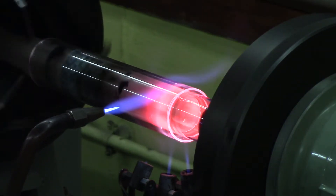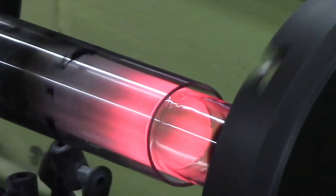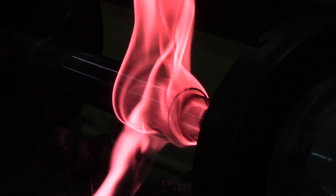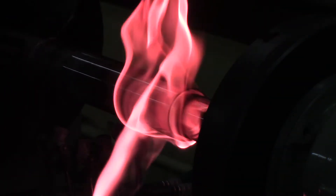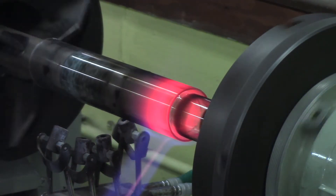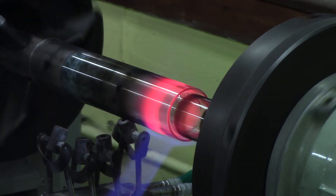The housekeeper will not get oven annealed — I will put that on the outside of the oven. Once I'm done, I'm going to reverse the process with flame annealing, starting with a very hot flame and working my way all the way down to a sooty flame. That's going to take about 30 minutes. Then we annealed it at the N51 annealing point of 570°C.